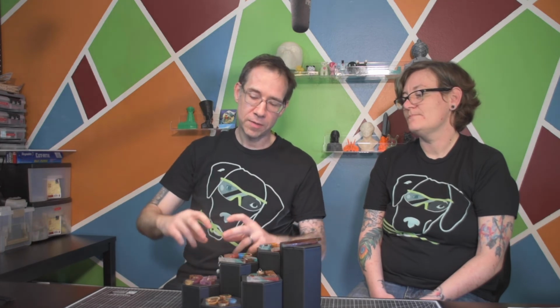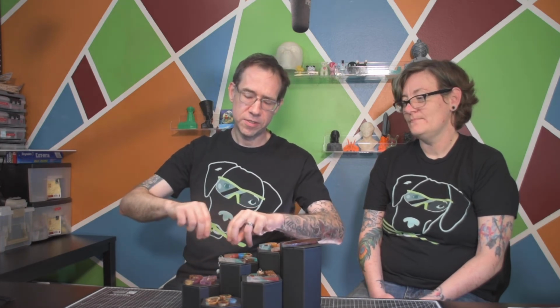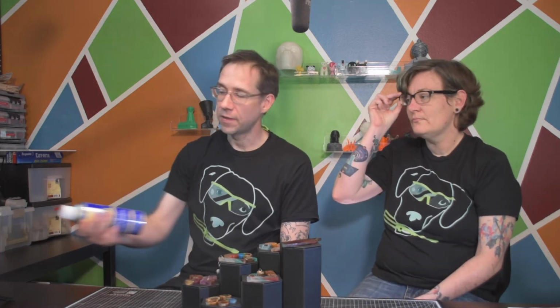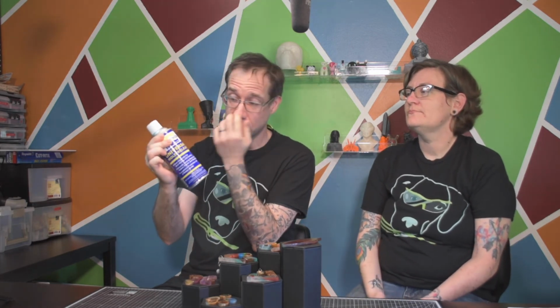And then at the very bottom, we just twisted what was left over of the clear tape and then wrapped it real tight with the aluminum foil tape, and that made a pretty nice seal at the bottom. And before we did any of that, we coated the Plaskolite with a lot of this mold release. And actually, the next time we do this, we're going to spray even more than we did that time, because it worked, but it would have worked better if we had put a little more on there.